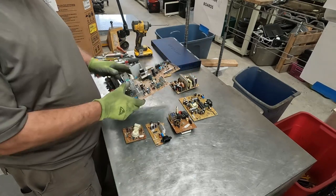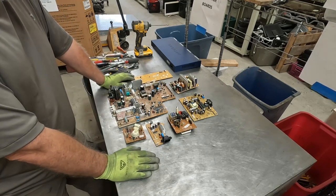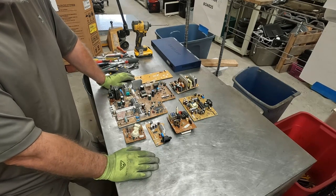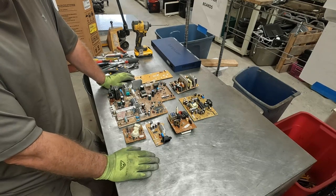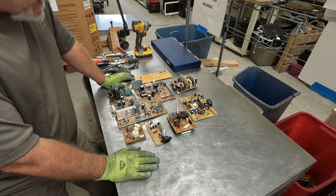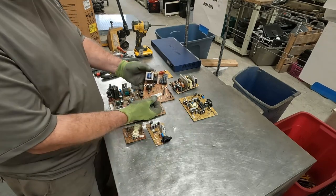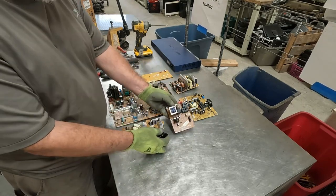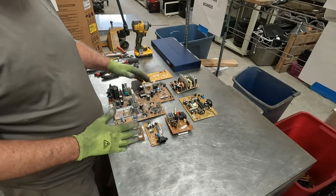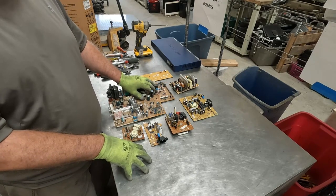This is where we start to diverge, and a lot of it depends on the sophistication of your yard. If your yard is primarily a scrap yard, a metal yard, and they also buy e-waste, then they probably only have three categories: high, medium, low. For that kind of yard, anything that has a lot of power-type components on it, such as these boards, would be called low-grade. If they see anything brown, they see any big power stuff, they're probably going to call it low-grade. They may even do the same for green boards that have a lot of power-type components on them.